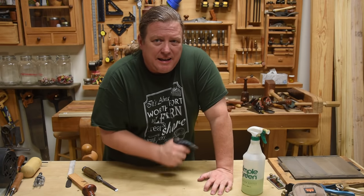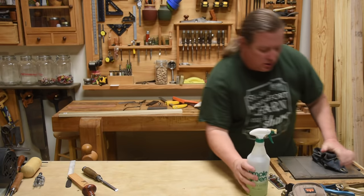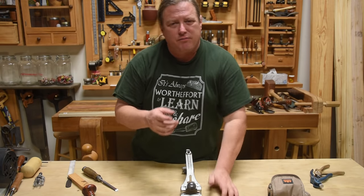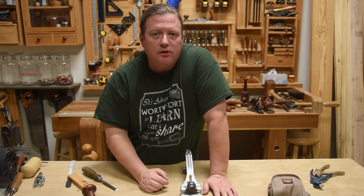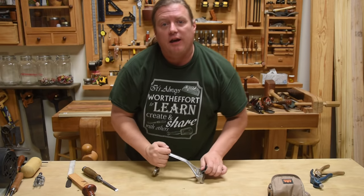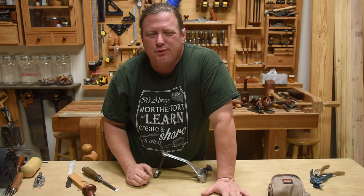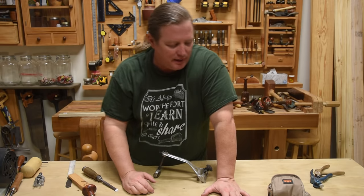I'll hone 20 strokes and then go back to stones in normal use — 20 strokes on the soft non-polished side, then flip it over to remove the burr. You can probably still see a little burr there, but no matter what, that is more than sharp enough for any kind of bench work. Even from the roughest state — totally grinding that edge off — it takes maybe a minute. Most of the time it only takes seconds.